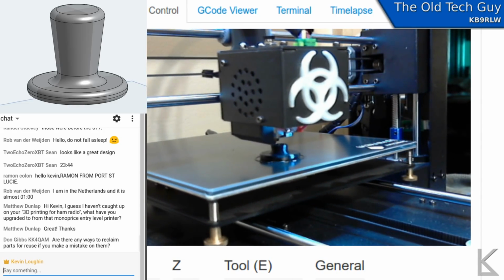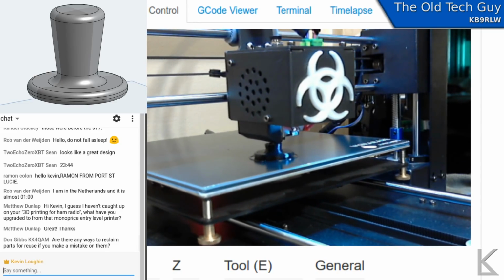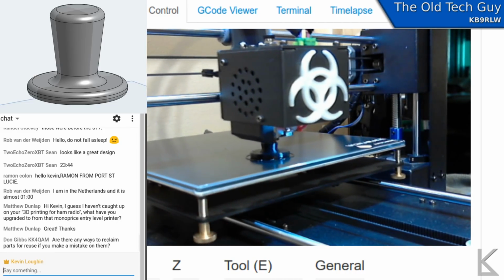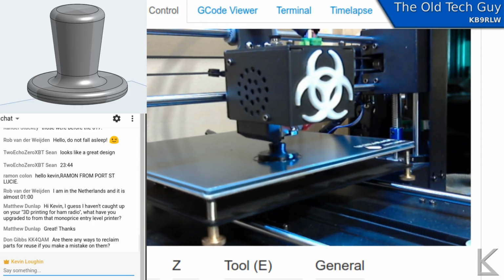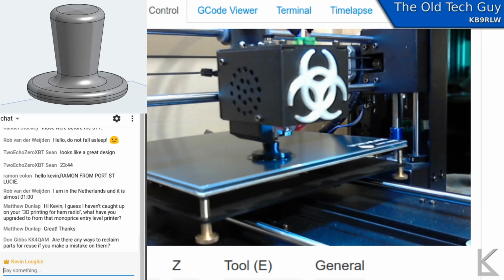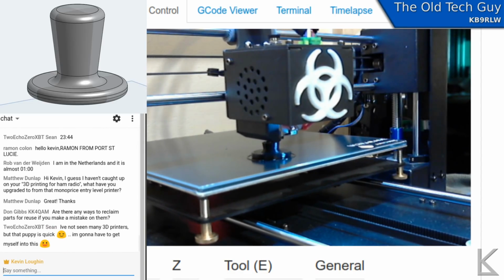Oh, there's a good question, Don. There are a couple of projects out there working on that, where you grind down the plastic and then remelt it and re-extrude it. And there are at least 2 or 3 open-sourced extruder projects for making your own filament. It's a little complicated. You have to draw the filament at a constant rate. That's what determines the diameter. It has to be processed ahead of time and dried, ground to pellets. And then the hopper where you melt it before the extrusion, it has to be at a precise temperature, and that has to be maintained. So it's a little complicated, but there are open source projects for building your own filament extruder.